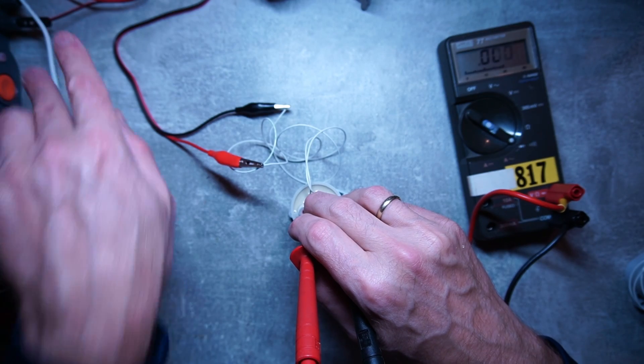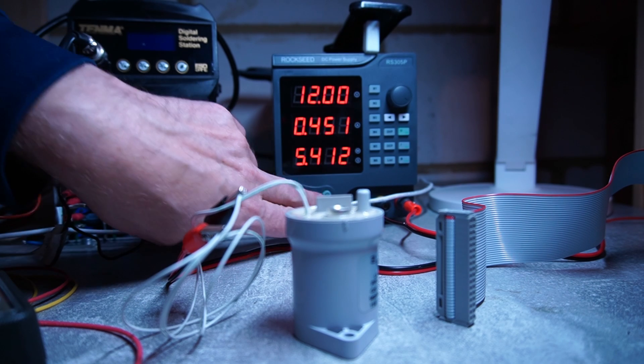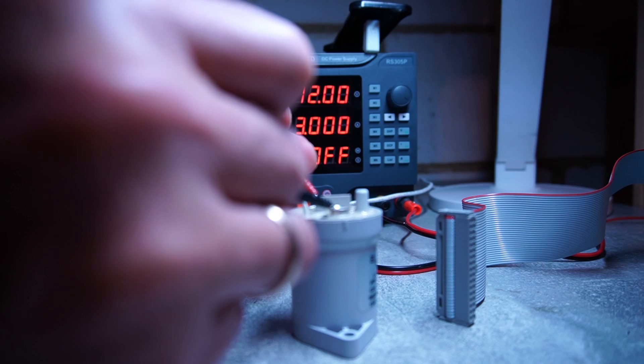And it's on — that one is working. In the open inverter board we have a number of FETs that operate various relays and contactors. One of them can operate the pre-charge relay and another can operate the main contactor, and they can handle only a limited amount of current as specified in the datasheet. I just want to check how much current my contactors are drawing at peak when being switched on. I set my power supply to current-limited to three amps and turned it on, and checked whether the contactor was energized — the test worked well, so I can now run it from the inverter.